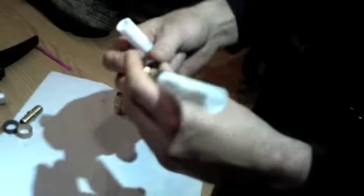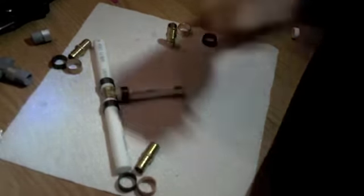Okay. Careful because this stuff slides around. You want to get it centered on the barb of the T for your crimp. There is our PEX tee. Now we just have to put these couplers on.